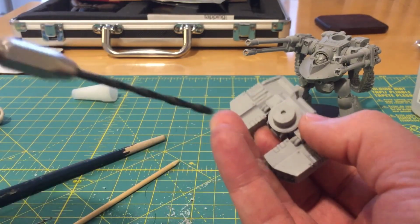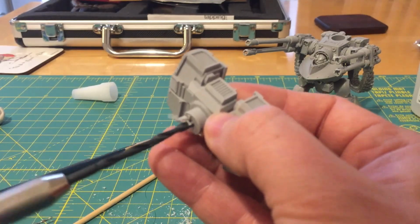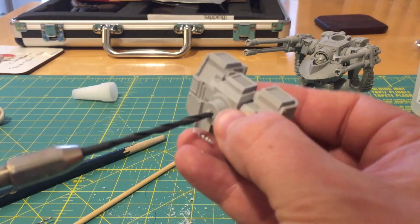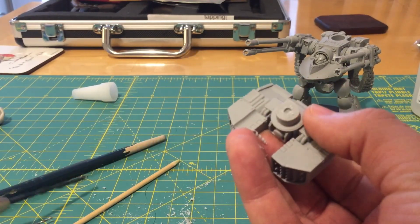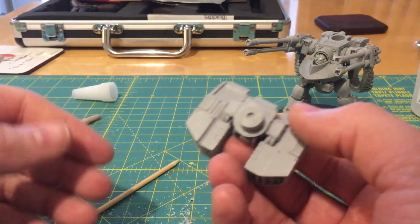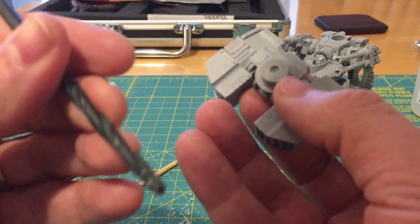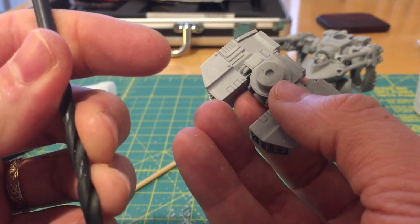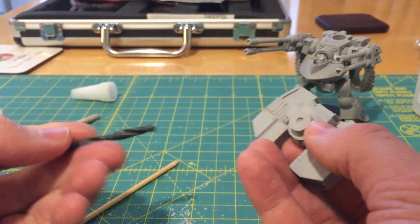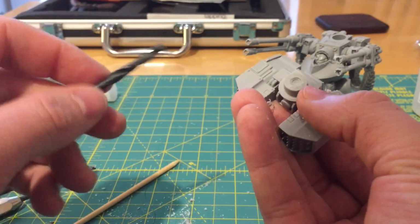So there you go, I used the first pin vise to start the hole, and then worked up a series of drill sizes. It just makes it easier to drill a hole nice and neatly and consistently. You avoid having to put too much force on all in one go, and you can check it as you move forward. Now going to the final 5mm drill. I think this is 5mm, or it's 3/16, so it's an imperial measure drill. So, not quite in millimeter terms.